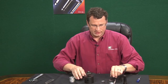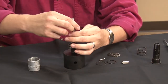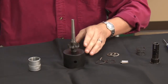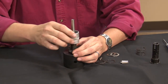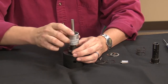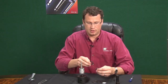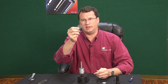Now we will begin to reassemble the tool. First, take your new mandrel and just screw it back into the shank. Make sure it's tight and snug, then take your bearing collar and screw it back onto your shank. Screw it about halfway down because it's a lot easier to assemble the other components when it's adjusted about midway. Now you should reinstall the thrust race. I always recommend repacking this thrust bearing with any kind of grease.